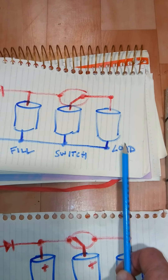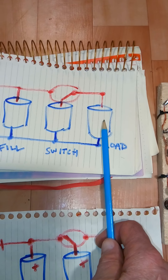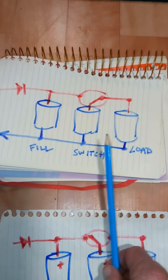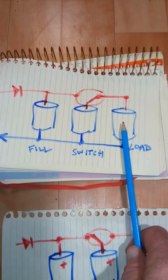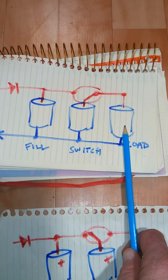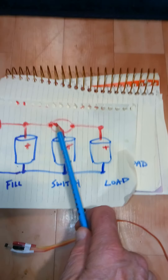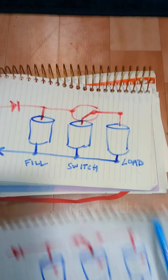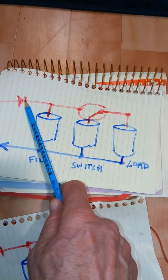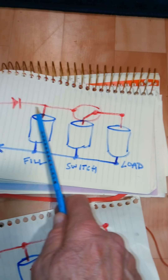You could have a pulse motor hooked here, or this could be a battery too — this is how you loop the flyback collected into the caps back into the battery if you want to do that. I'm going to have this cap run a second motor. This is the load. Obviously you don't have these switches on at the same time — one happens, then the other happens, not simultaneously. What's nice is this cap is always being filled; there's no off time when you're not filling a cap from the flyback.